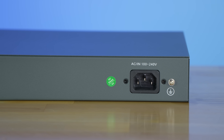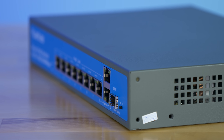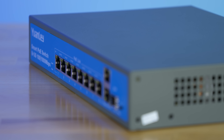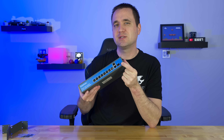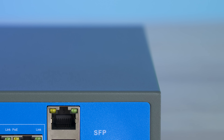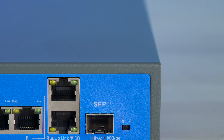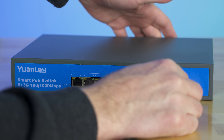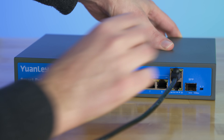This is an unmanaged switch, but according to their website, the Amazon listing, and their own material, it supports something called an extend function, which pretty much switches it over into virtual LAN mode. To do that, you have a little switch on the left-hand side that turns it on and off — either going into VLAN mode or just regular mode. According to their documentation, the switch is supposed to separate everything into its own VLANs and make everything more secure.